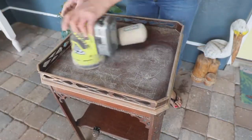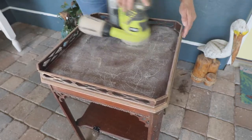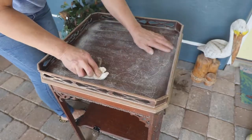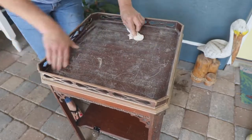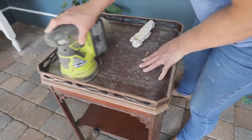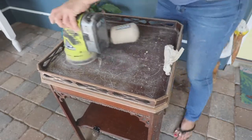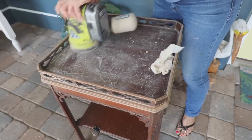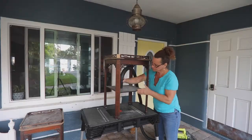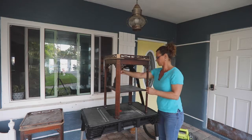The next day, I lightly sanded the deepest gouges out of the tabletops and shelves with a random orbital sander and 120-grit sandpaper. You'll be able to feel when the gouges are gone or almost gone by running your hands over the areas you've already sanded. I also lightly sanded the edges of the trim and top of the table's fretwork to be sure it was all smooth and none of the old finish was peeling off. If you have a shop vac, it helps to go over your furniture piece to remove as much sanding dust as you can after sanding.